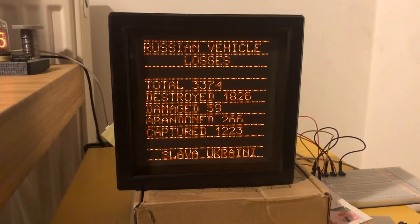So the second part of the project is very simple - it's just an API which pulls the website and does the text processing for me. The ESP32 talks to that API, which runs from a Raspberry Pi. There's a Docker image included on my repository with full instructions. You install the Docker image onto a Raspberry Pi, which parses the website and provides the relevant text via the API. The ESP32 then makes GET requests to the API to get the vehicle numbers. This could of course be used for any website - you could pull any information you want and display it on screen.